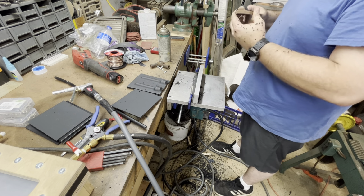Again, that extra 1/64 of an inch on those holes really helps take out any additional error that wants to shift this off center. Gonna check no splits. Edges are still flush. Now, I'm not going to show all this on camera, but I will still take a belt sander just to take all these slight little chatter marks out of the edge of the kydex, flush everything up at 100%.